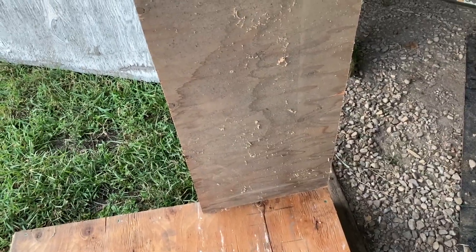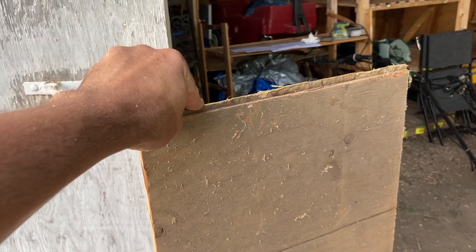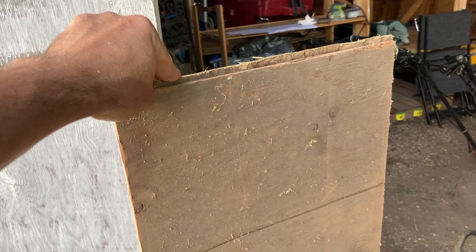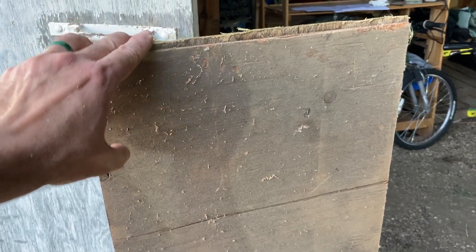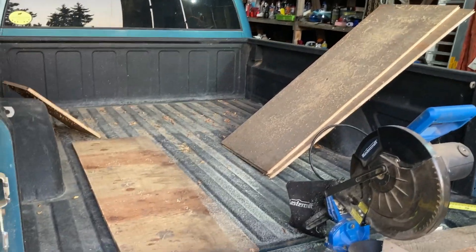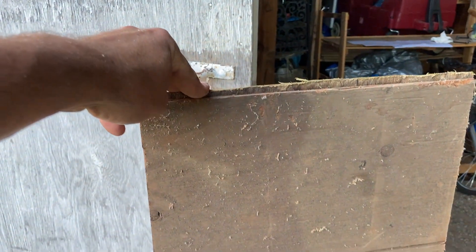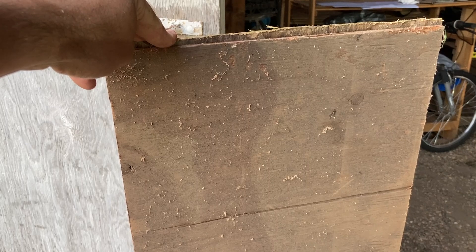Next question is how high. Right now we have 48 inches — four feet — based on this base, but my kids aren't that tall. They need to be able to lift hay into it, yet I have to be under that 34 inches so we have space to load and compact more toward the end of a bale. I think I'm going to compromise at about 42 inches, which means cutting about six inches off the top of all four pieces.